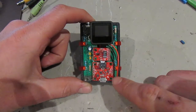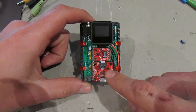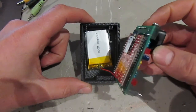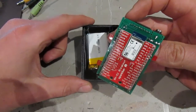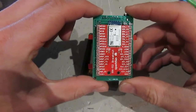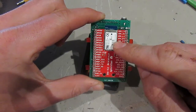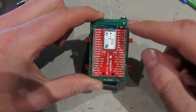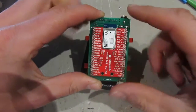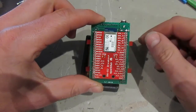On the bottom we have one of SparkFun's lithium polymer battery chargers. This provides power to the entire board and charges the LiPo battery hiding in the bottom of this case. And that brings me to the back side of the board — this is the RN52 Bluetooth breakout module, also from SparkFun. I believe the RN52 chip is from Roving Networks, and it controls the interface between this board and your smartphone or whatever Bluetooth device you're connecting to.